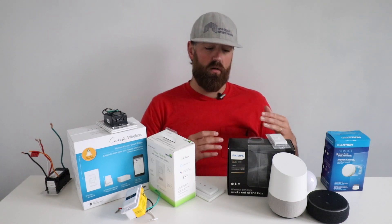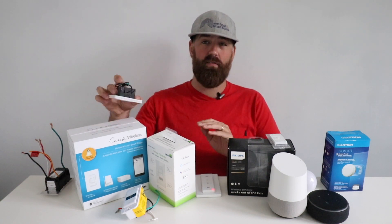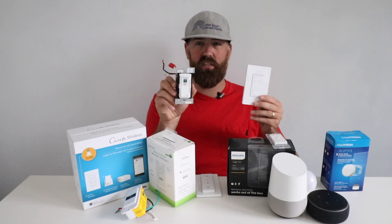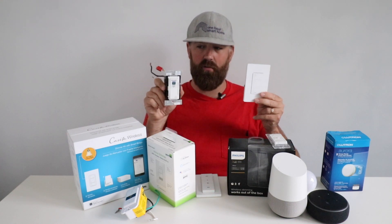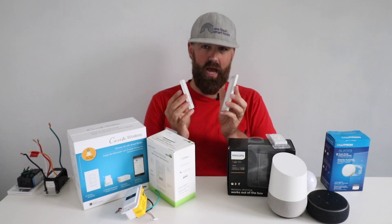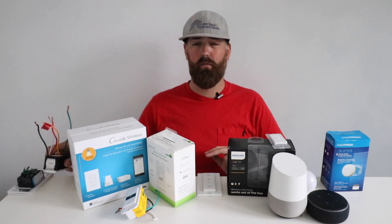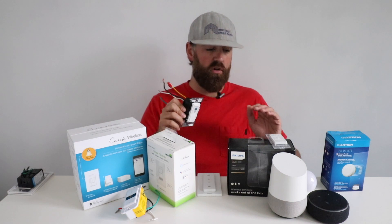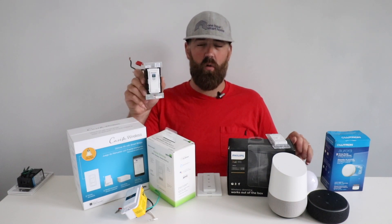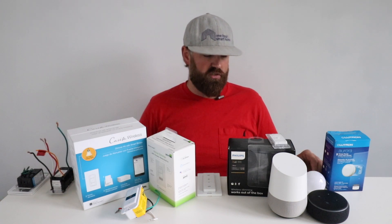Overall, there is a big difference between wireless light switches — like this Philips Hue completely wireless light switch — and a Wi-Fi light switch, like either of these, that work on a Wi-Fi network and connect to the internet for control. The wireless light switches can connect to the internet for control, but they have no wiring at all. They're battery-powered, and you'll need a hub. Versus Wi-Fi switches, which are more permanently installed and let you control multiple lights with just one switch based on how your circuitry is wired. We hope you enjoy this video — please give us a thumbs up, subscribe to the channel, and click any of the links below to support us.